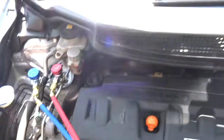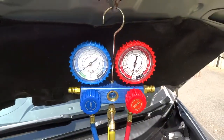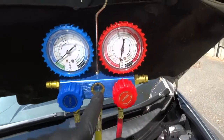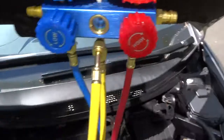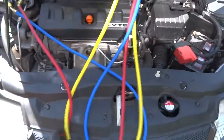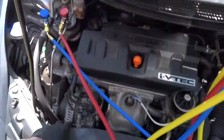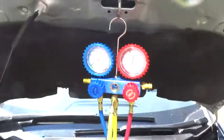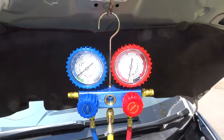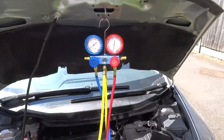Now when they're on, make sure all the ports are closed so there aren't going to be any leaks. Another good thing about these is the sight glass, so when you're filling you can check your refrigerant coming in. And the long leads — the longer your leads are, the less chance you've got of getting a slug in your compressor when you refill. So long leads, good gauges with all the gases on, the sight glass, these screw connections — I can't fault these gauges at all, they're brilliant.